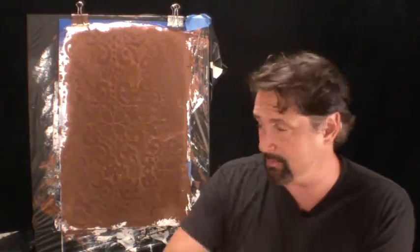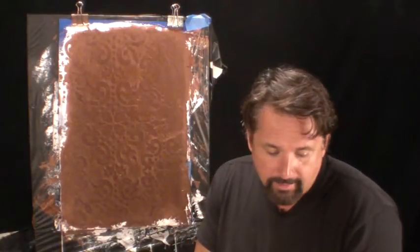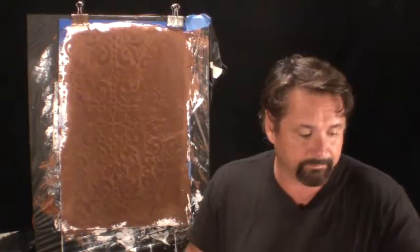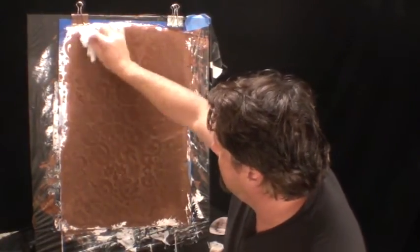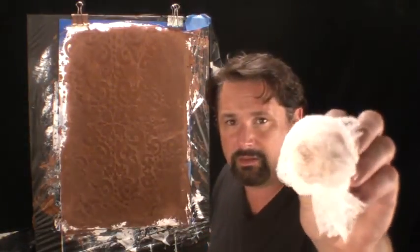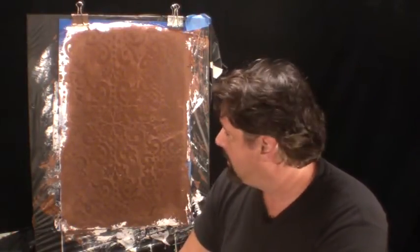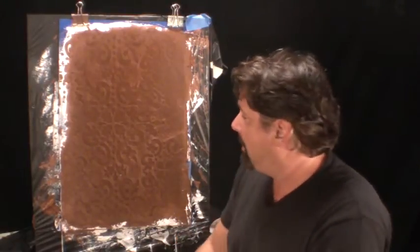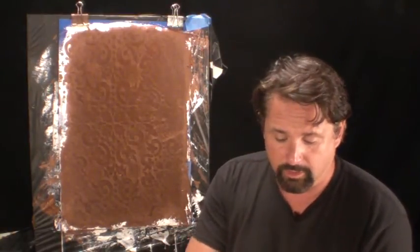We could leave it like this if you're happy with it. But it's also a good idea to do a quick test — rub it a little bit and see if anything comes off. When doing some of these dark finishes, like tricorn black, there's a lot of pigment. Knowing that the color could come off, you don't want to put this somewhere in a home or restaurant where a lady in a really pretty white dress leans up against it. We should seal it. Italian polishing wax — we'll use the clear. You're in control of the finish; that's the beauty of it.